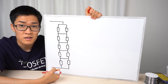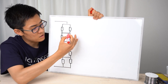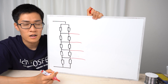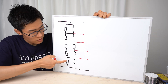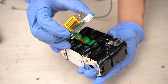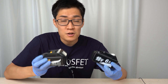This is the genuine battery configuration: five sets of two parallel batteries are connected in series. Four wires are connected to monitor the voltage of each battery individually using the IC chips on the control board. The voltage of each battery is monitored — if any of the cells experiences an overvoltage, protection will be activated immediately, so no further overvoltage occurs. There is also an orange part inserted between the battery cells to detect temperature, meaning the genuine battery can detect overheating.